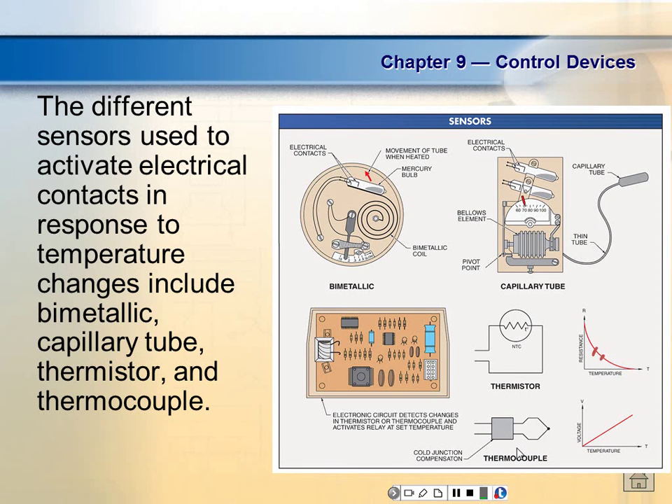I have a gas water heater in my house. It turns the valve on and off for the gas, but it doesn't plug into the power company. How can it open and close the valve? It uses a thermocouple. It will not turn on the main gas until the pilot light is lit. The pilot light has a thermocouple in it — the thermocouple generates a voltage that energizes the main gas valve. If the pilot light is out, the thermocouple generates no voltage, the main gas valve never opens, and you don't get a dangerous gas buildup in your house.